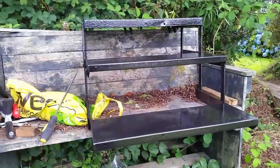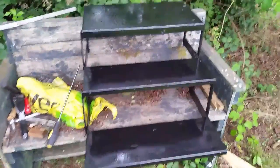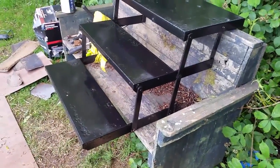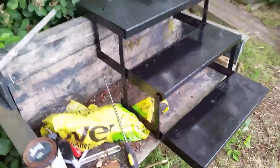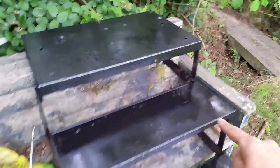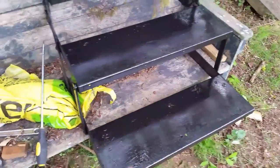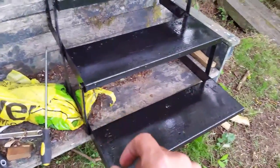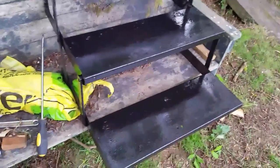The steps have had their second coat of metal paint, and I have to say, considering the state they were in before — all seized up and everything — they've actually come out quite nicely. What I've got to do now is when they're dry, attach a new piece of waterproof flooring on these two steps, and then there'll be an aluminium angled piece to go all the way around, which will be screwed on and siliconed underneath so that no water can get into the back of the step again.